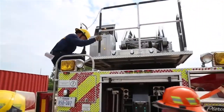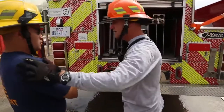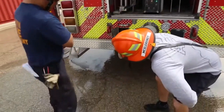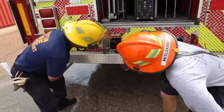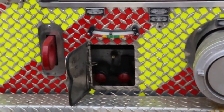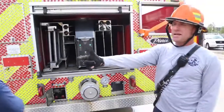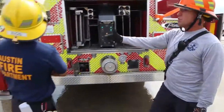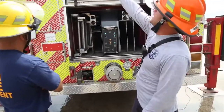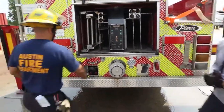And what you're going to do, help me out with your name, I always forget it, brother. Renee. Rios. Okay, thank you, Renee. Renee's going to go in here and he sees aerial override and it's pull to do it. Can you raise it? He can't do it. So he needs his buddy, Rios, to come down here. And what I want you to do is you'll tell him once you pull the plunger, I got it pulled, and you'll be able to raise the aerial. Go ahead and do that, sir.